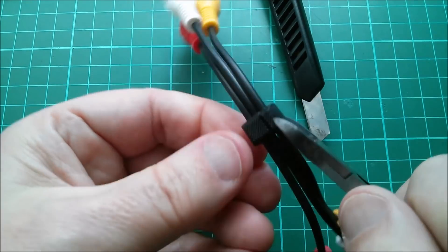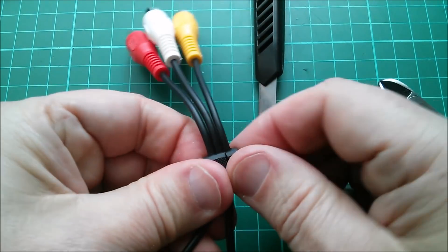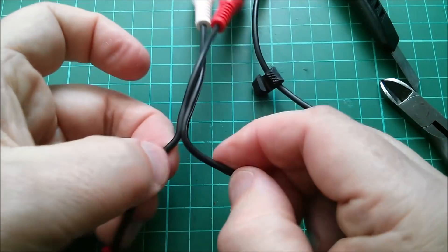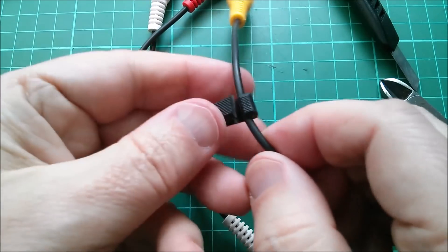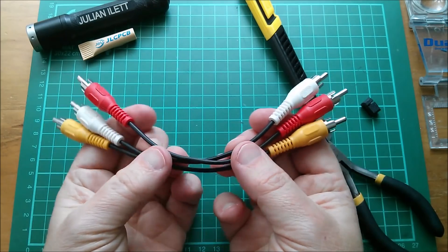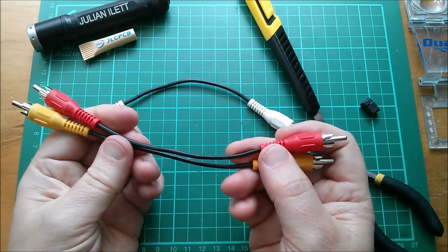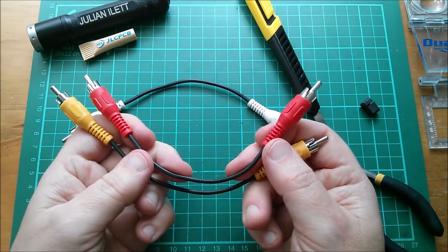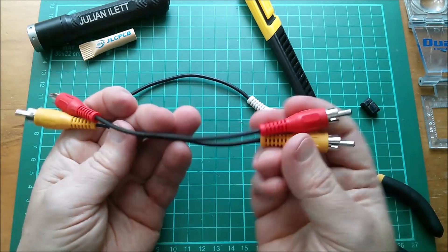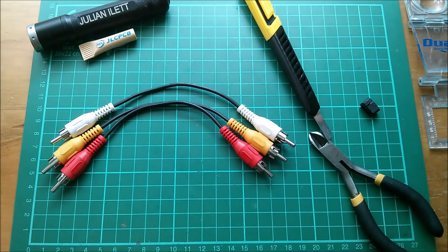Peel the yellow cable away from the other two and they come apart — yes, they do. These come out quite easily, they're only loosely molded in there. So three entirely separate pre-molded RCA to RCA shielded cables — probably not braided but screened with a slow-twist outer screen. I've got this thing about pre-molded cables; I just like them. I don't like making up my own cables with that inevitably loose-fit strain relief. There's something rather nice about pre-molded cables even though the connection inside is probably worse than one I'd make myself.